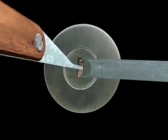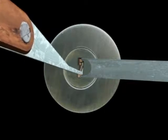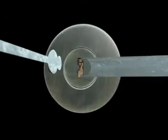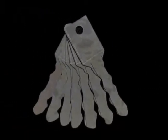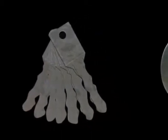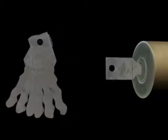When picking wafer locks, you can use most of the same techniques as with pin tumblers, with the exception of impact and vibration techniques. Due to their nature, some special tools were developed specifically for these locks. One such tool is the tryout key. A locksmith might have a large collection of such keys, which more or less resemble actual keys. They vary in size and shape in the hope that if one doesn't work, the next one might.